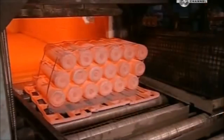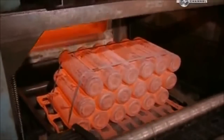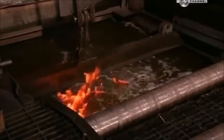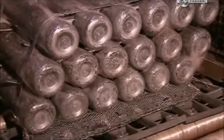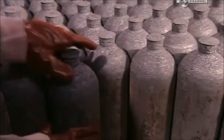18 cylinders are placed in a furnace heated to 900 degrees Celsius. After 90 minutes, a machine dunks them in a chemical bath to cool for six minutes. The cylinders are then reheated to 650 degrees Celsius for 90 minutes, then left to cool for two hours. These transitions between hot and cold — a process called tempering — strengthen the metal and make it somewhat flexible.